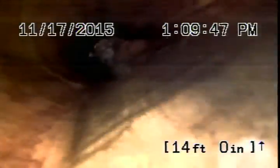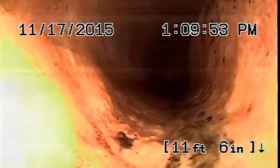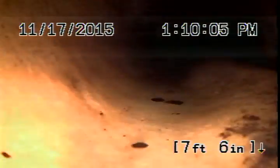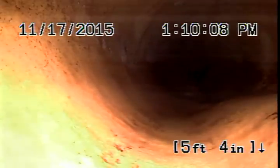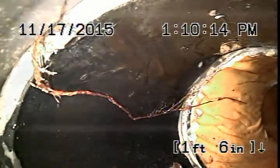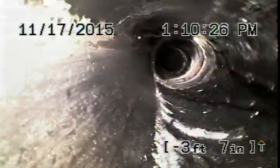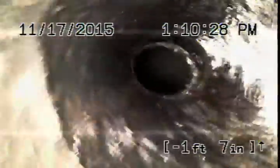There's a toilet stuck right there and it comes back out. I'm thinking a major root from possibly the oak tree on the left side of the house is pushing up on this pipe. This right here is the worst 10 feet. I traced it out — it starts right at the property sidewalk area, six feet deep, then goes approximately 20 feet into the street where there are problems. At the sidewalk it's six feet deep and at the street it's 6.5 feet deep.